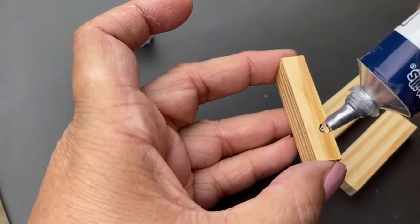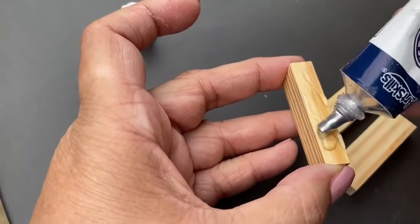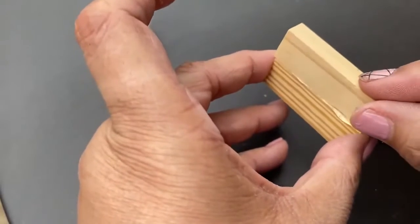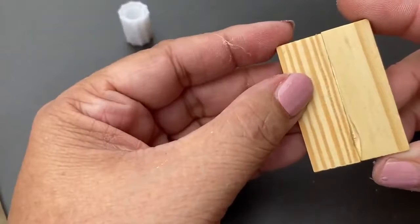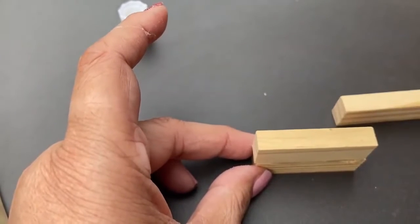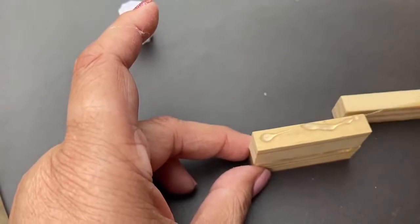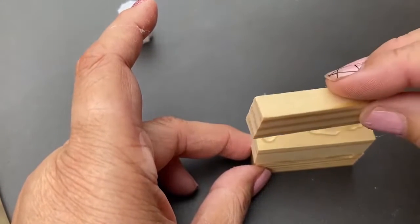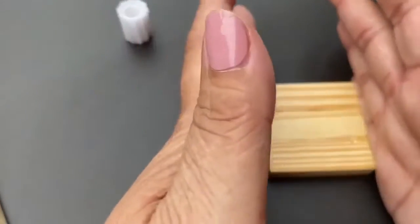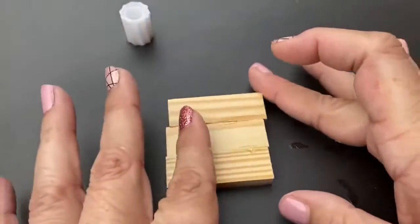Glue the sides of two of the blocks. Lay it right on top — this glue is really thin and you can see how it squeezes out the side, so I have to wipe off that excess. You just don't need a whole lot of it. Place them on top of each other and line them up really well before laying them on the surface where they're going to dry. Let them dry overnight on a hard surface — metal or plastic — where they won't stick.